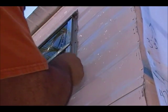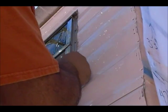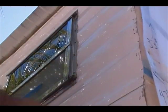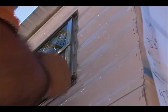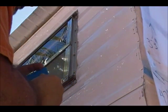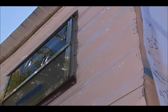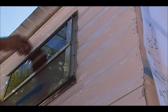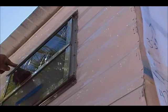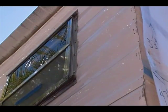What you're seeing me do is — I had a spot where I could see white and it looked like it wasn't getting in there. So I'm packing it in and making sure it's making contact underneath. Basically underneath here you want to trim it up — there's not much to trim. Remember water goes down, so the top is very important — make sure you get the tape up there. All of them had the tape squeezing through the hole, so I know we've got good contact. Now I'll do the other side.